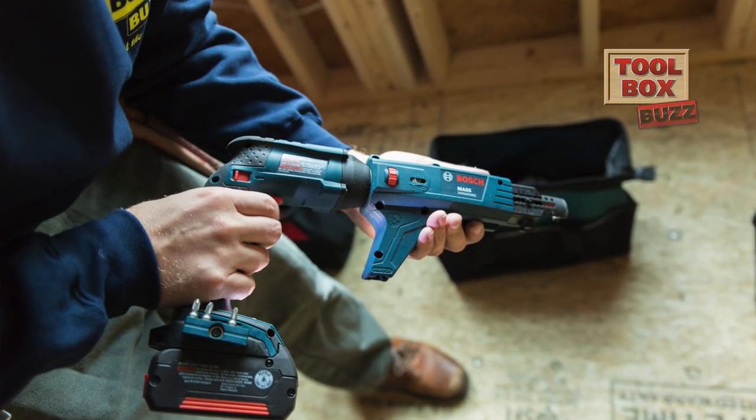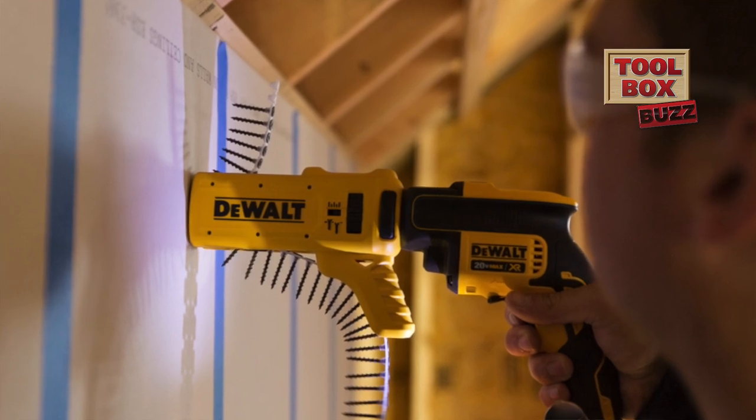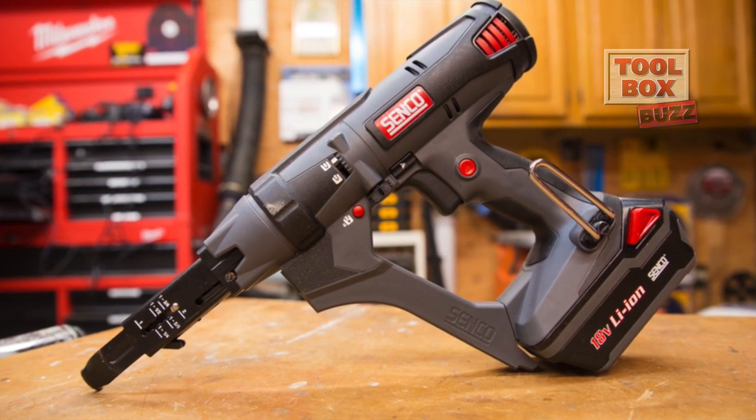We compared all drills using collated screw attachments, with the exception of Makita which doesn't offer one. Bosch and DeWalt performed very well and consistently drove screws without a problem. Their auto-feed attachments are surprisingly similar to each other, which makes sense since they both accept the Senco brand screw clips — no jams, consistent depth of drive, and the same reload process. Senco's strength in this category comes from its sole collated design — it's collated only with a super effective auto-feed — making it very fast. Its 16-inch length also makes overhead work and decking easier by getting you closer to the work.